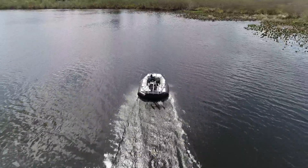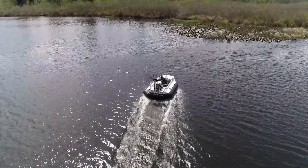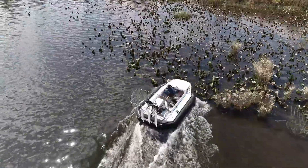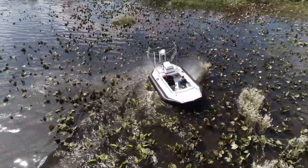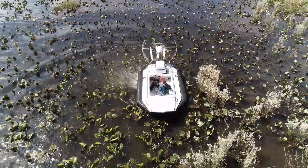Fully actuated, the hull's planing surface comes into contact with the water. This far exceeds any slowing you could get from reverse thrust. Once the hovercraft is going slowly enough, the rudders can be put hard over and the craft spins on its nose.